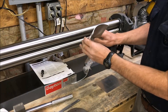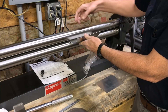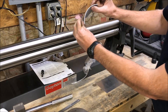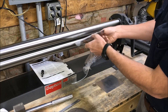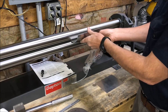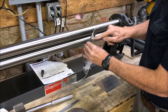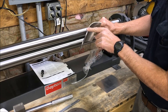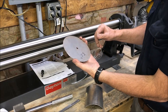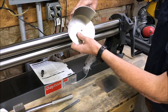Since I'm dealing with such small parts I have to worry about the flat. When you first put it in, there's a distance between the pinching rollers and the back roller, so the first bend is going to leave a flat. I actually have to flip it back and forth as I'm rolling it and do incremental bends — bend it to a certain radius, increase the radius, run it back through both sides to eliminate the flats and get the proper diameter. I use a diameter gauge, pieces of steel cut to a certain diameter, and basically just bend it until I get the proper curvature.